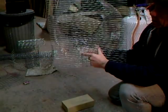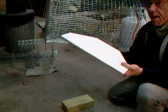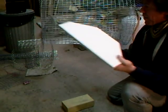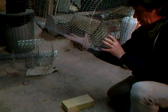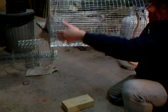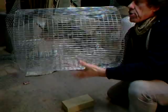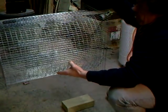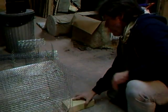What I plan to do is have a hole at the base at this end of the kiln. The shelf is going to go in sideways, utilizing what I've got — these shelves are going in sideways all the way along here and they'll locate themselves inside going crossways. The burner is going to be underneath, so the flame comes in underneath and swirls around, over the top, and then out. There's no conventional chimney — just a hole on this end, the same end where the burner goes in, not on top.